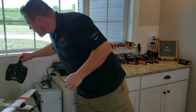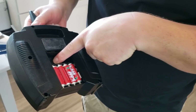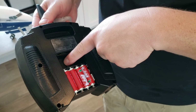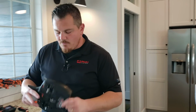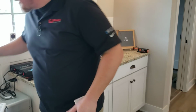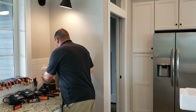The DXS has a little plug right there, that one. And you can buy a little adapter plug, or you could just build one. It's the same pins that are used in a servo connector, but that happens to be the top pin and the bottom pin plugs into the outside pins of this servo wire. So if you're curious, while I was doing my research, also you can assign, if you update the firmware on your DXS, up to four different profiles in the airplane mode and four different profiles. I don't know if it's simultaneous on the helicopter mode. So I just learned that, so I'm passing it along.